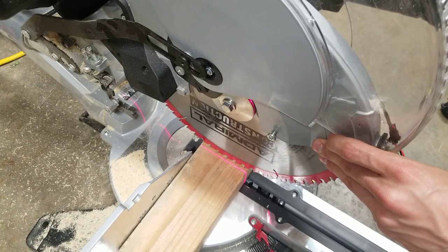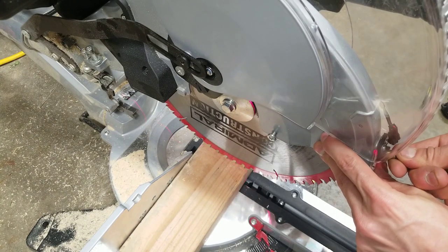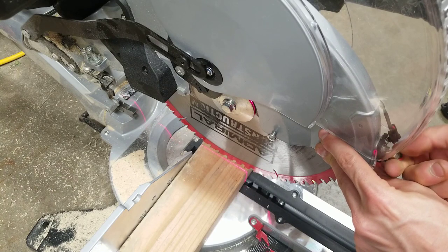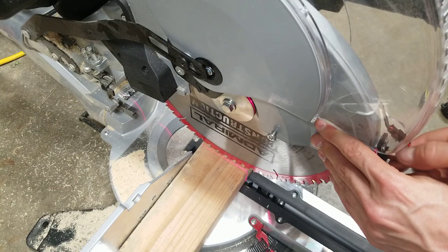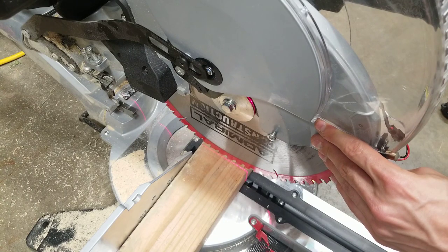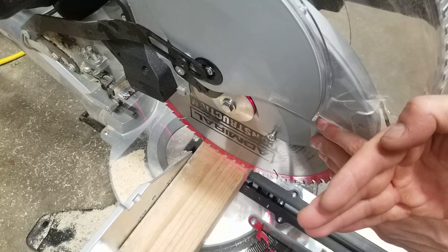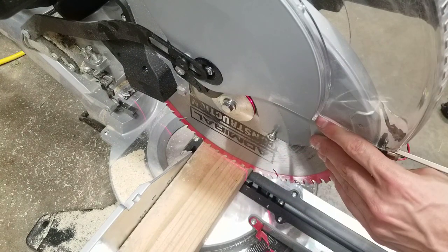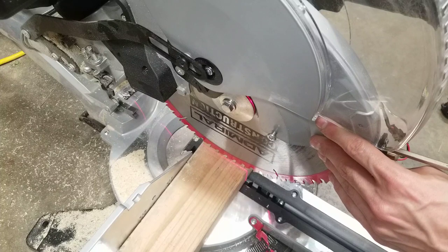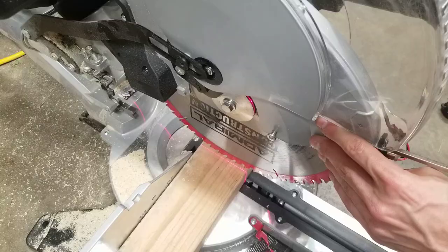You can see that moved the laser in quite a bit and it's still in line with the blade. If it's slightly offset at this point you can rotate the laser housing since it's loose — rotate it and move it along the workpiece to get it closer or change the angle. The way mine is right now I can get it fairly close and it's still in line with the blade. To reduce the remaining offset I'm going to tighten down the left screw. This causes the housing to rotate inward as you tighten, moving the laser body inward toward the blade. I'm tightening the left screw now while the right screw is still fairly snug.